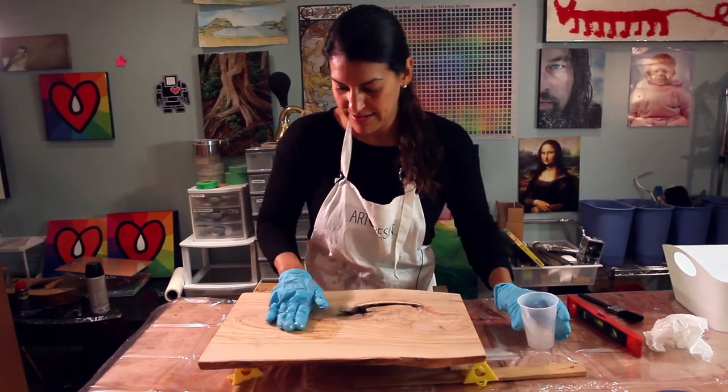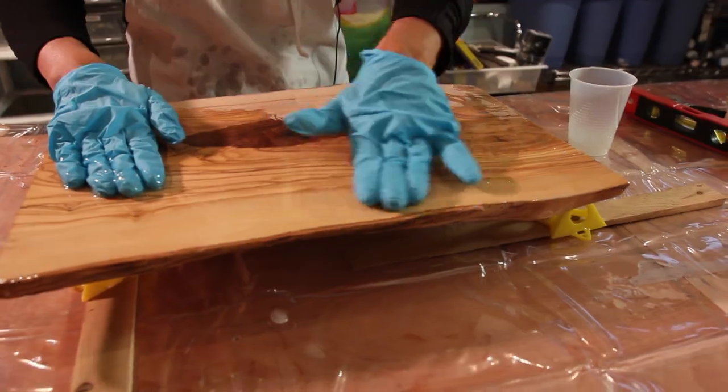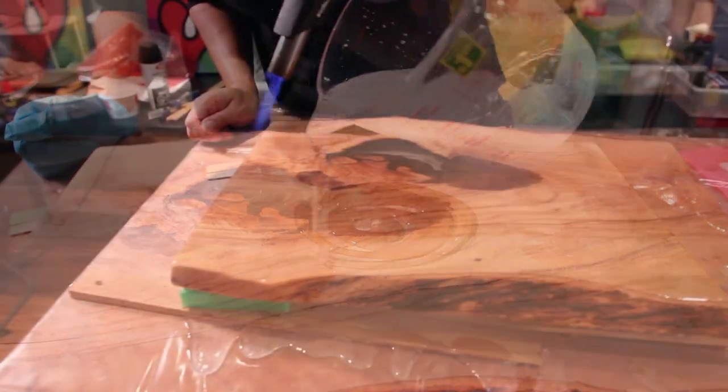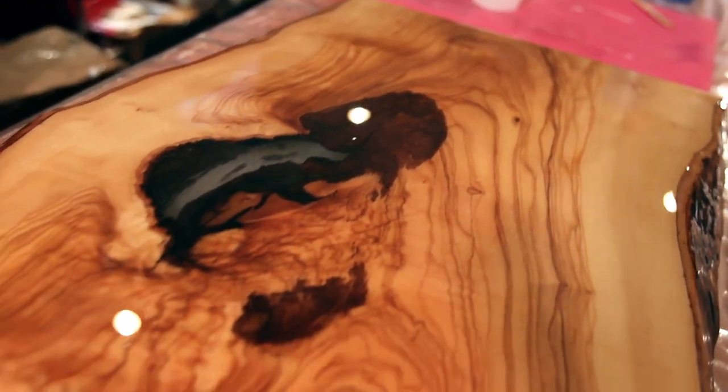This same technique will apply to an organic wood surface. You can use a polyurethane, or you can use several thin coats of Art Resin to pre-seal your piece. You want to lock in all the air that's settling underneath the wood. Then, once that's perfectly dry, you can pour a carefully mixed and measured coat of Art Resin. Torch the bubbles out, and you should have a perfectly crystal clear, bubble-free finish.